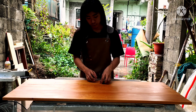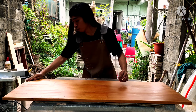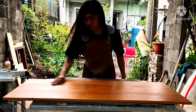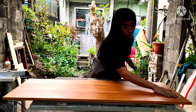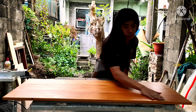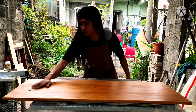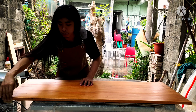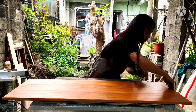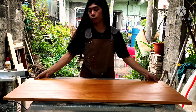After the third coat, to give a very nice and smooth finish that feels great to the touch, we sand with 1000 grit very lightly. Just light strokes going through — you don't need to remove any material or remove any roughness. These light strokes will do; don't put any weight. Then do the grain-side edges as well.